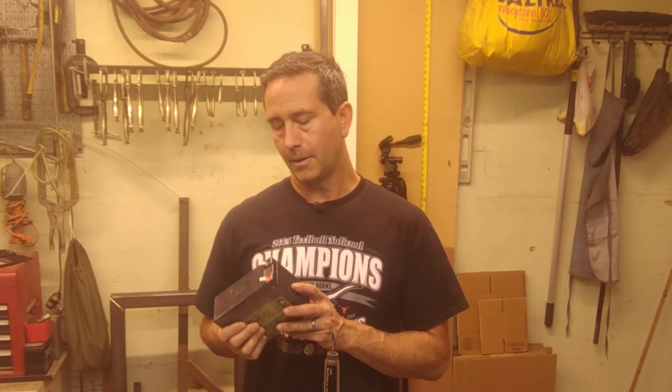Now, this is a 10 amp hour battery, which means it's going to go down in about an hour. However, if I hook up my battery tender to it, it'll replenish some of that power as it's being consumed, and then overnight it'll keep it charged. So this battery may not be big enough, but I could certainly get an automotive battery or a deep cycle battery that would allow it to deplete somewhat during the day and then recharge overnight. So it's a constant buffer. That might be the most economical way to go. Plus, sometimes it's handy to have an extra battery.